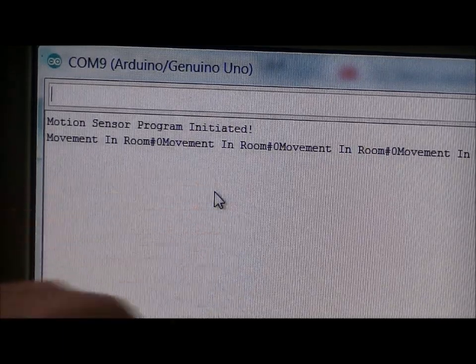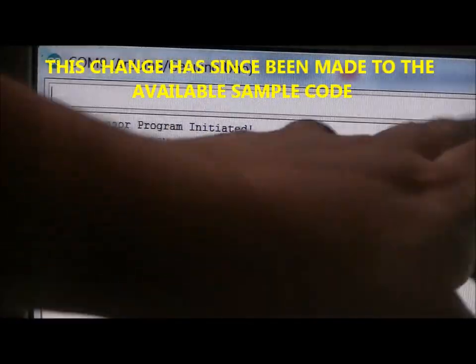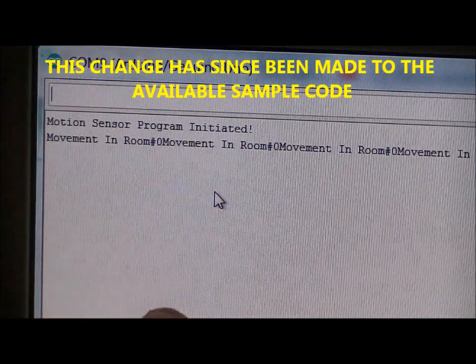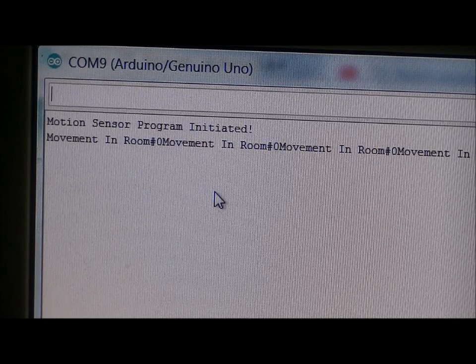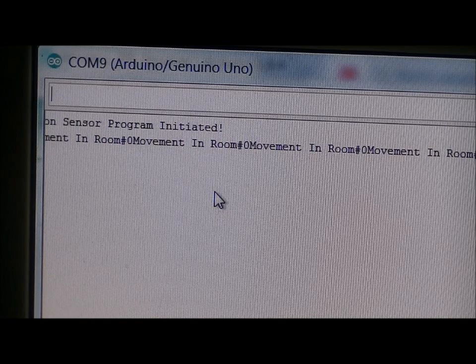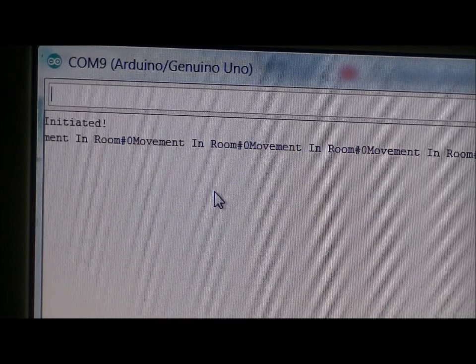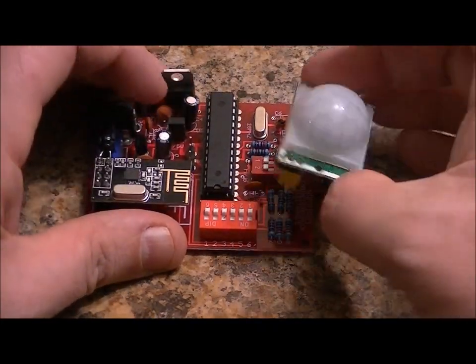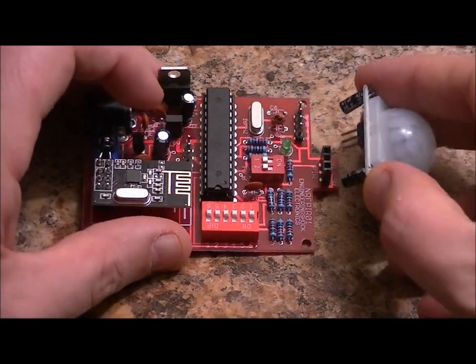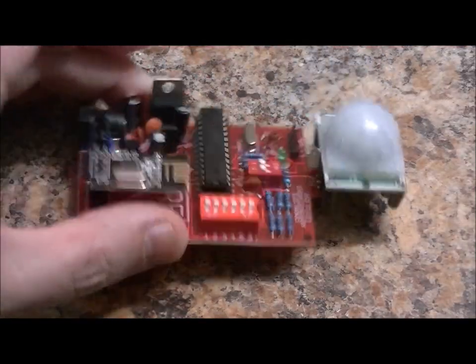That's very simple. I'll make a change to the code so it uses print LN so instead of going side to side it just keeps lining down — I'll make that change once I'm done this video. The sample code is available if you've pledged towards the Kickstarter campaign, and you can modify it as you see fit. It will come to you with everything connected but the PIR sensor. The PIR sensor only fits in one way into the three-pin header — you have to fit it in like this, just three pins. It plugs in quite nicely. Make sure it's sitting nicely and you're ready to go.